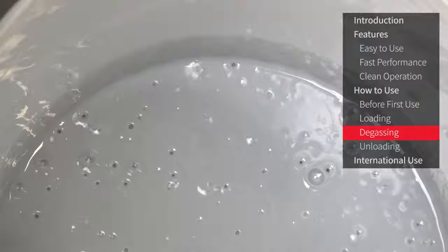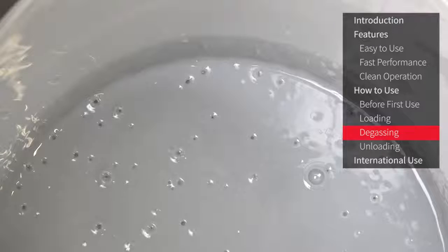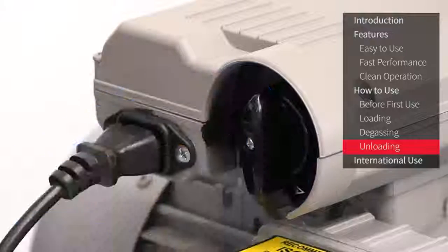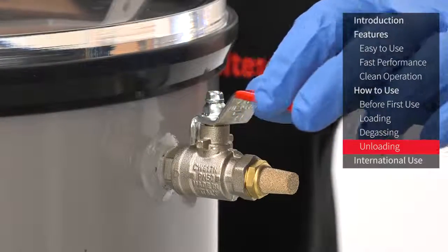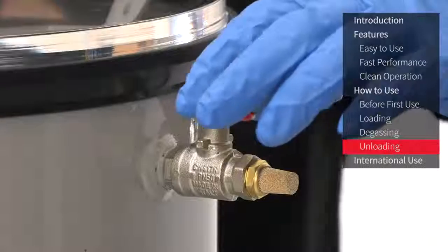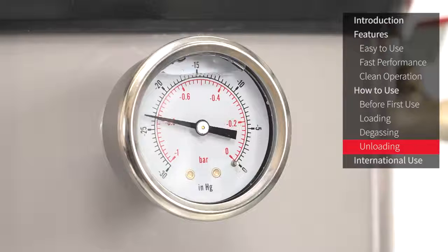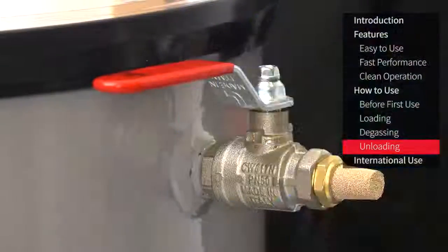It's essential that you stop degassing and use the material whilst it is still comfortably inside its pot life or working time. To stop the degassing process, switch off the vacuum pump and then open the air inlet valve to let air back into the chamber. The chamber is fitted with a filter on this inlet to prevent dust and dirt being sucked in, and you can control the flow to prevent too much disturbance. Once the chamber is back up to normal pressure you can remove the lid and remove the material. It's a good idea to close the inlet valve now, ready for your next run.